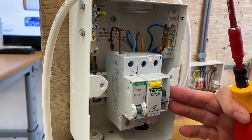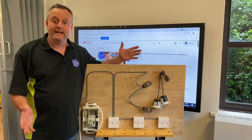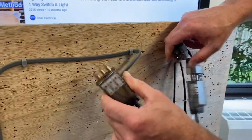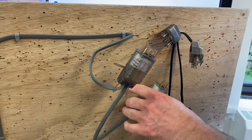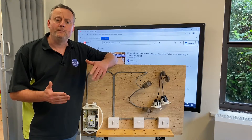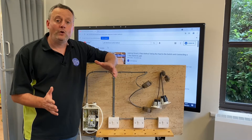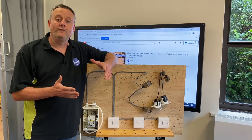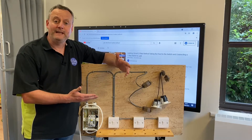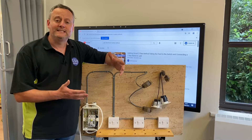We're now ready to get the covers on and remove the loads to carry out the insulation resistance test. We've put all the covers back on and removed the sensitive loads — in this case the LED downlights — as we don't want to pass 500 volts DC through them. We also need to think about switch positions, as we don't know whether they're on or off, which is crucial for AM2, AM2S, and AM2E assessments.